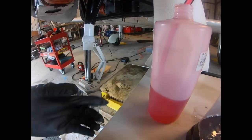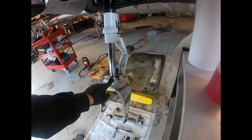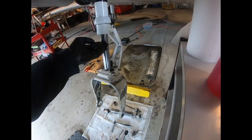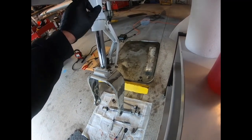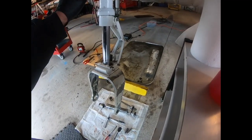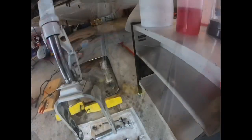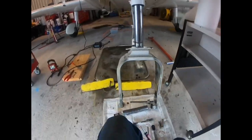and once this stops, the next point is to prep the cylinder for compression. So we're going to squeeze a bunch of it out. We're not going to compress it completely. We're going to probably leave it maybe a half inch in the compress, then we'll put the air core valve in, and then we will recharge the cylinder with fresh nitrogen.